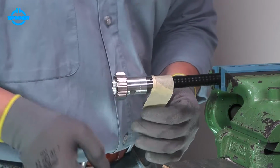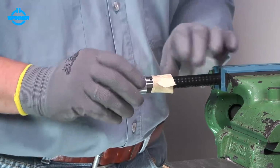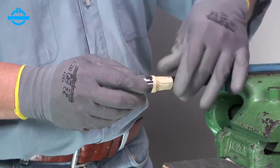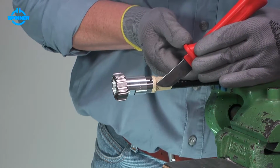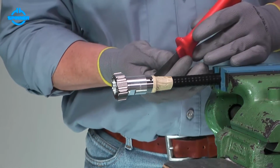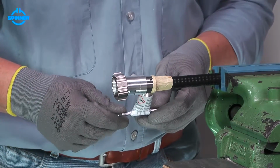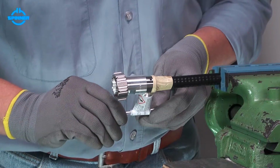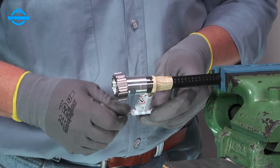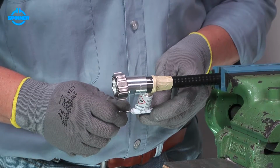Tape the gap between back nut and cable jacket to prevent Plast2000 leakage. Pierce the tape to ensure an air outlet when filling the connector with Plast2000. Screw the Plast2000 tube into the charging hole. Squeeze tube slowly to fill the inside space equally. When Plast2000 leaks from the vent hole, it has filled the main inside space of the connector.